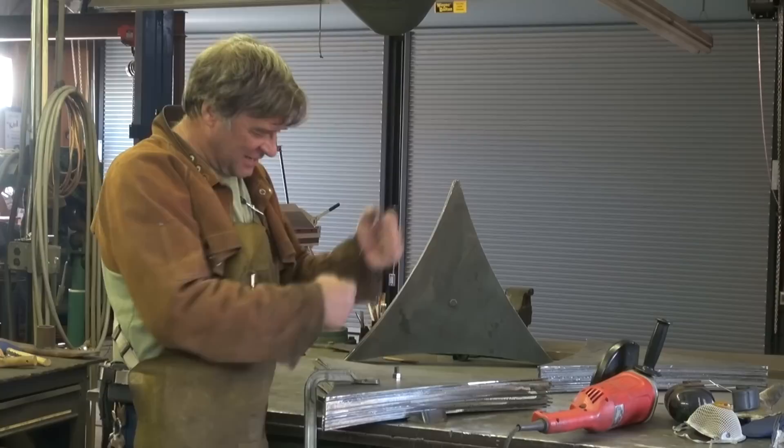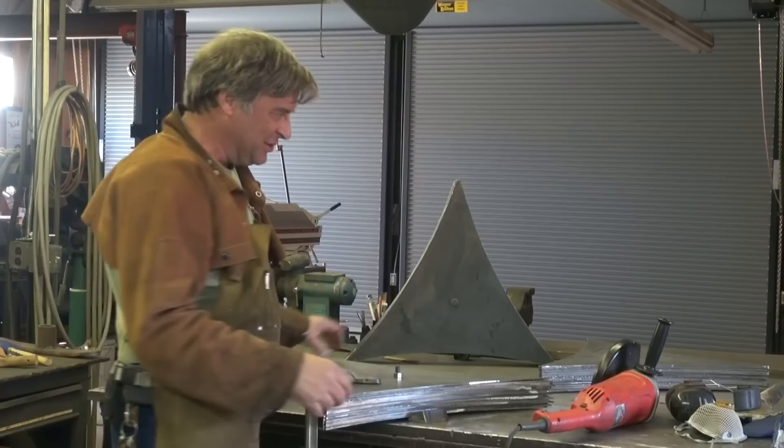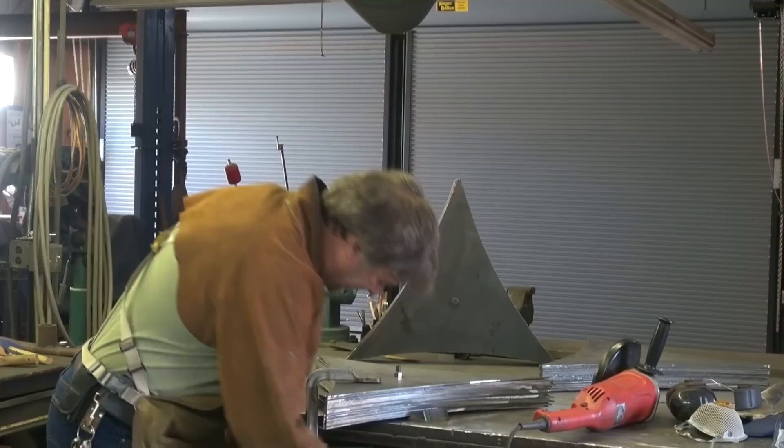So now I've got two more ends to go here. Let me spin this guy around. I've got wedges under it to help make up for the thickness of the bolt head, trying to get it flat and level, and clamp it to the bench so things stay still — so while I'm cutting, I'm not chasing it across the bench. Then I can finish those two, start rolling out my half-inch rod. Got to lay out an eight-foot circle on the ground, roll that up and make that rod fit. Then I can start putting these on the rod and start welding it together. More steps, more steps, more steps.